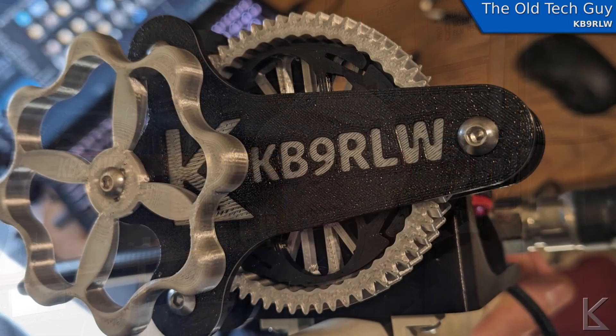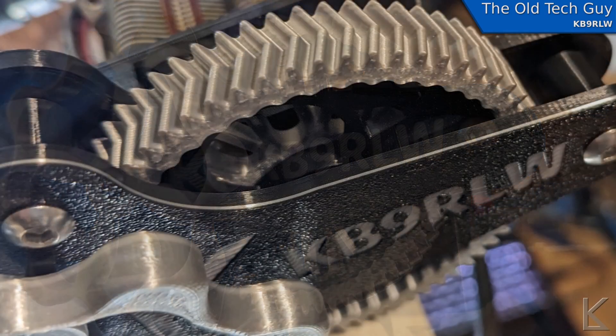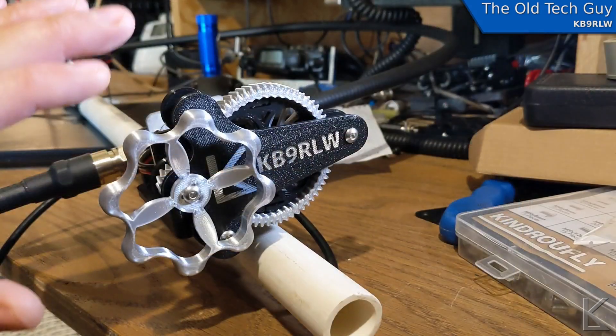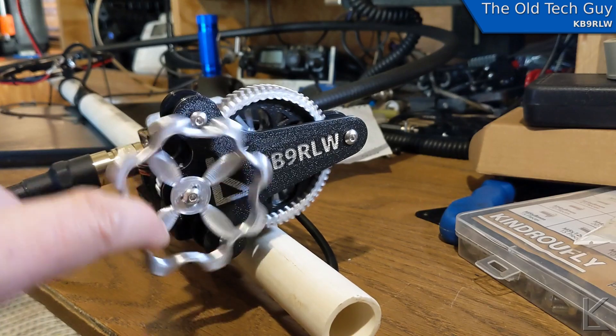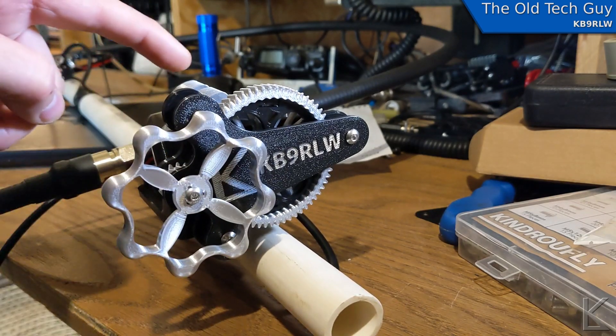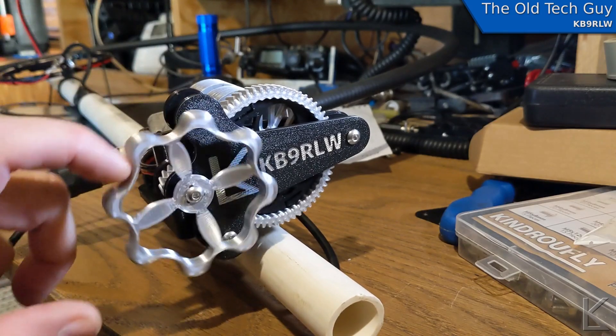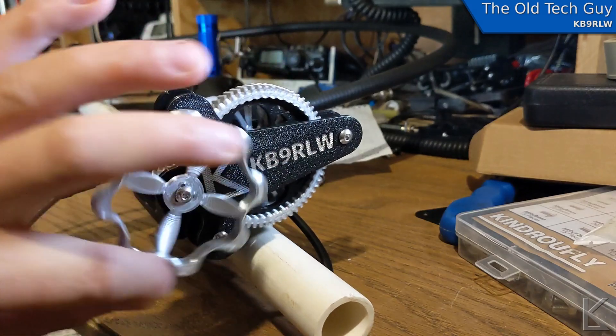The other thing I did — you can kind of see it back here, let me show you a close-up — I made a geared-down transmission to drive the tuning capacitor on the loop. And I'm kind of proud of this. This is my first foray into designing gears in FreeCAD — I actually designed these gears from scratch using the gears workbench in FreeCAD. There's an extra little feature in here too: I made a clutch. So this is my geared-down tuning for the loop. You can see the capacitor back here rising up and moving. I've got two sets of herringbone gears, and it's almost a 4:1 reduction.